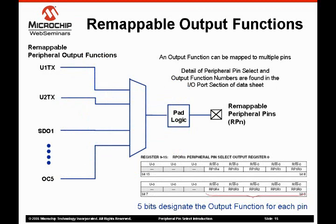The remappable output functions of the PPS are multiplexed so that any of them can be connected to an RPN pin. To maintain flexibility, the PPS logic contains no hardware-enforced lockouts. An RPN pin is mapped to an output function by writing a 5-bit value designating the desired function to the appropriate pin mapping register. The 5-bit value associated with the desired output function is written to the RPORX register for the intended RPN pin. Mapping the output function to the pin prevents multiple output functions from being mapped to a single pin, eliminating the possibility of contention caused by multiple outputs on a single pin.